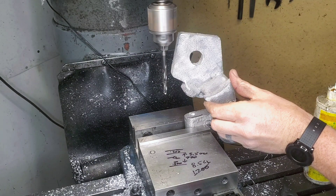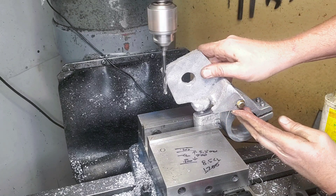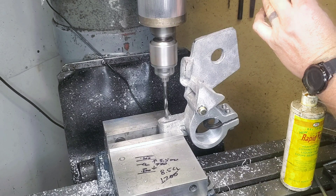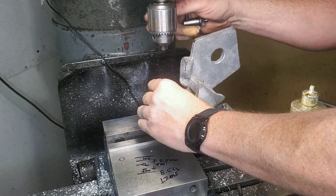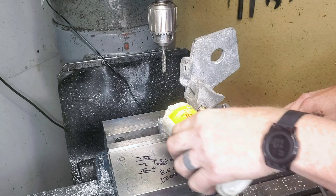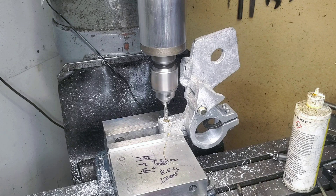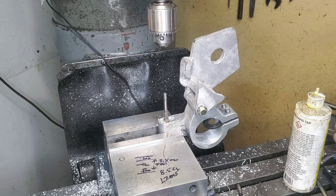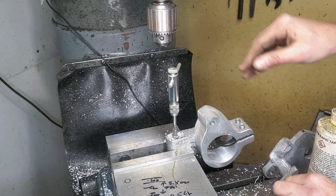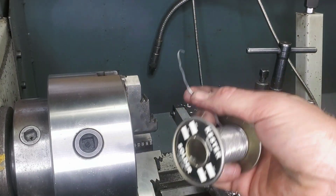It's not too late to turn back if I don't have everything lined up yet. Off camera I hit zero when I started drilling that hole, so it's just a matter of putting my cross slide back to zero and I'm back in business. One of the things I frequently do — and keep in mind my belt's a little bit loose on my milling machine — is I'm just going to quickly power tap it. Because I've already drilled the hole and it's in location, I'm just going to bump the head on the milling machine, have it spinning a bit, and use its inertia to slow down and start the tap in there. Hopefully I'm only going to get maybe three or four turns in there — this is a bit of a dangerous game because if it breaks off, I'm going to be in trouble.